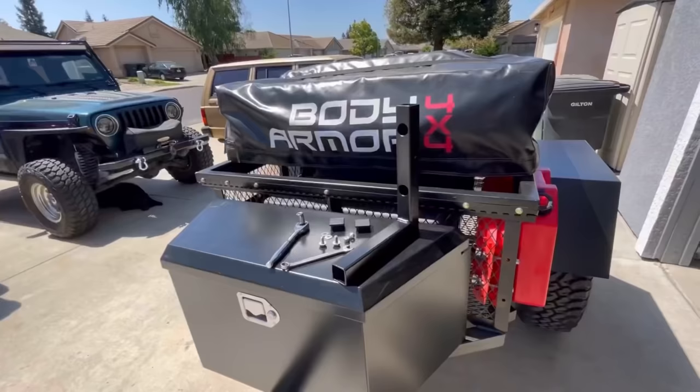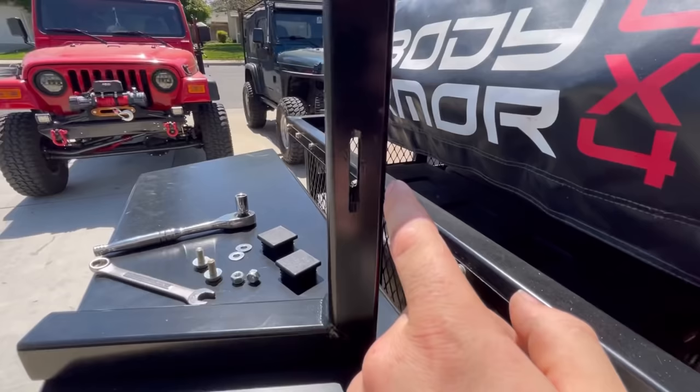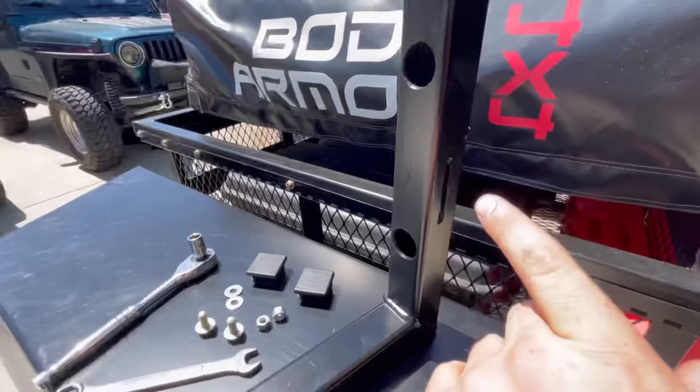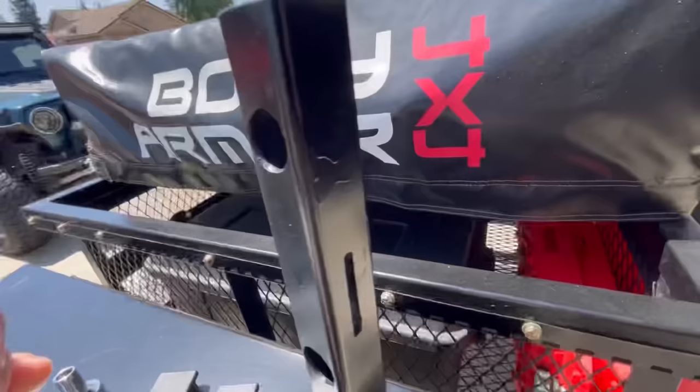Here's the mount we just made. These are the poor man slots — you drill two holes, then cut each side on the outside of the holes and you get this long slot-looking finish, which is pretty cool. I've got one on both sides so we can pass our clamps and cinch straps through here. I've also got two one-inch holes so I can have access to the back of the material to bolt it to the trailer.